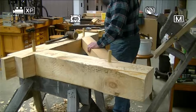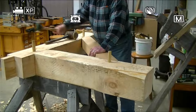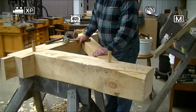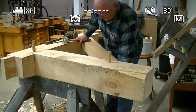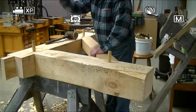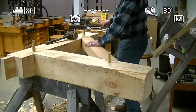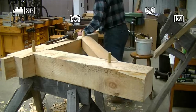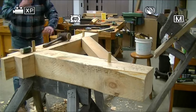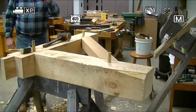If you listen to the pegs — I call it tuning the pegs. I know they're tight when they're all the same pitch. And now the pegs are through the hole. The pegs are not identical, but they're similar. As I'm pre-assembling things, I'll lightly peg them just to kind of hold it in place. Then when we actually raise it up, we'll drive it tight. A week later, we'll come back and tighten them again.